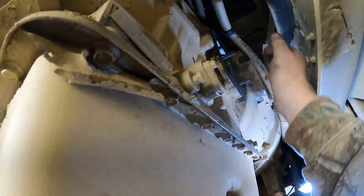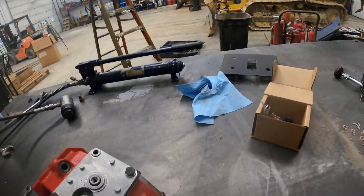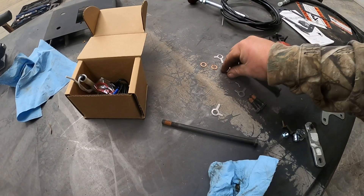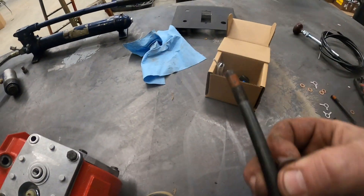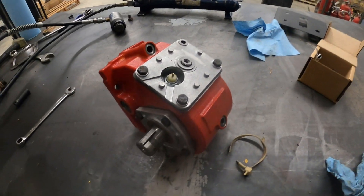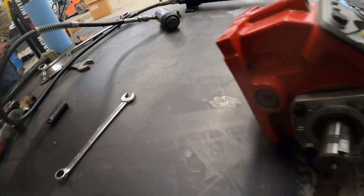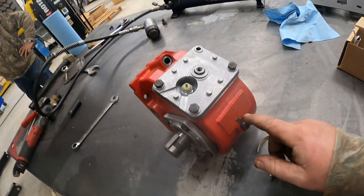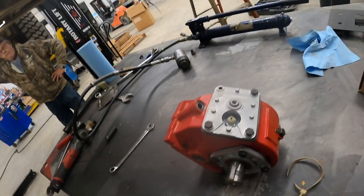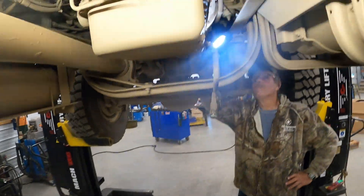I got my surface all cleaned up. The rest of the holes I'll use bolts. One thing you definitely want to do is use copper washers — those are your sealing washers — and they actually have these lock tabs on them. The lock tab goes on first, then your copper sealing washer. Notice this one bolt is super long — you definitely got to have this one in here before you slide that PTO up in the frame; if not, there's no possible way to get it in there after. The rest of them you can get in after the fact.